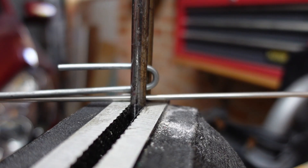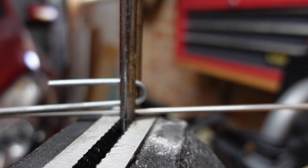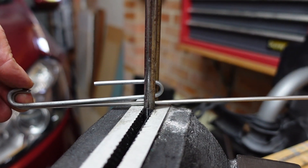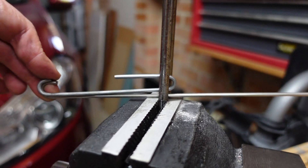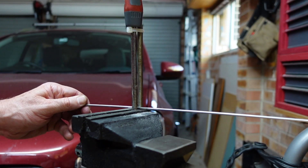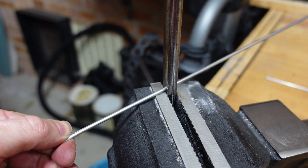A line at this end, and then you want to hold your tongue at the right angle and just put it in there and pull it back until you can virtually see no gap on the inside of the original template to the edge of the screwdriver. That is the point that will get you pretty precisely — to the nearest millimeter or so, it'll be pretty good. Hold that in there like that, and I reckon that's pretty close now. What you want to do now is bend it 90 degrees.